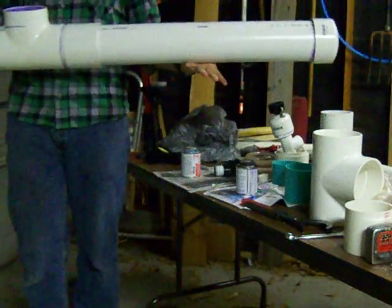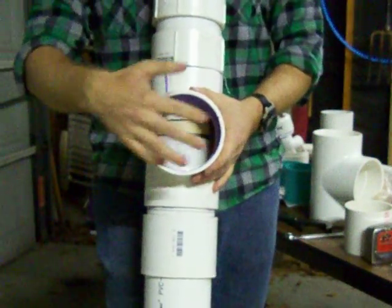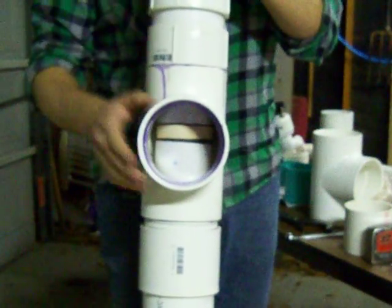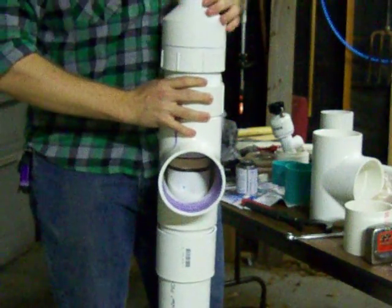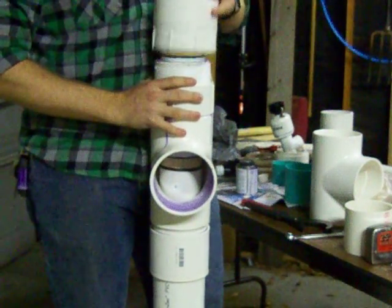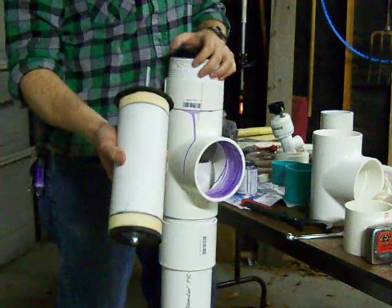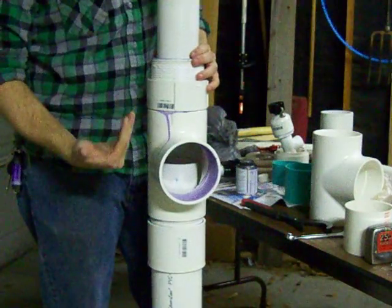This thing is five feet long, just about. It's got a homemade piston and a homemade piston valve right in there. You can see how it's sealed right now. The top part is the piston, which moves, and the bottom part is fixed in this part of the chamber. We have four-inch pipe cleanouts right here. The four-inch cleanouts allow access to the piston should the piston destroy itself during operation, which would be hard to do because we're using foam instead of rubber. But even rubber would tear pretty easily. Here is the piston itself. There are little holes through it so that even though you can fill through it, it won't allow air back the other way.